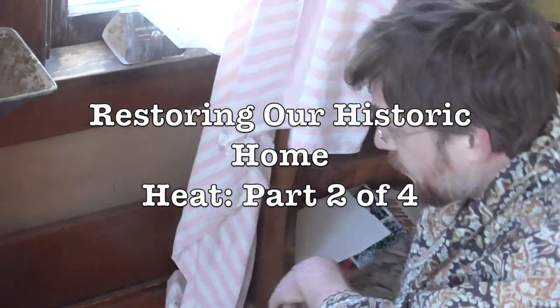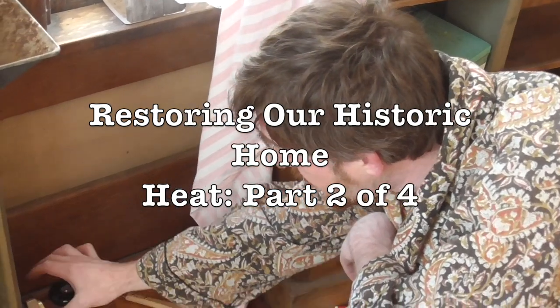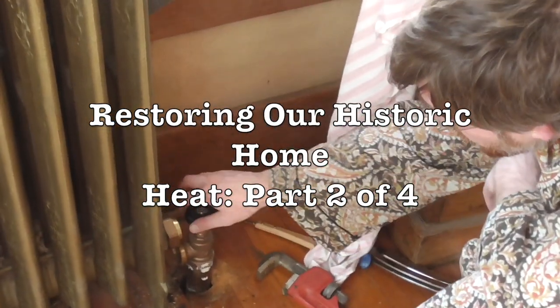I need to make a little bit of room for the pipe to flex out of the way so that this union spud doesn't get damaged when we lower the radiator into place. So Sarah is standing on a lever to hold the radiator up while I try to do what the British would call some fine fettling.